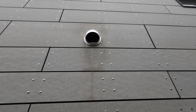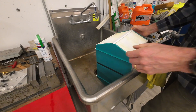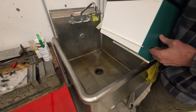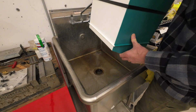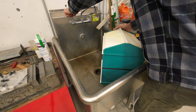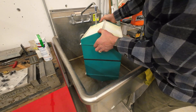For me the output is on the other side of the house and I can't get to it easily without a ladder, but I can at least check it and see how it looks — it looks fine there, if not a little bit dirty or moldy right where it comes out. So now it's time to clean the heat exchanger. They say you want to do it against the direction of airflow — I think the air is coming in from the bottom and going up through it, so I'm going to push water down the other way. They say that if it's green or blue like this it's okay to wash it; if it's all white you're not supposed to wash it. The instructions say hot water. I'm just going to run that through it — it doesn't look particularly dirty, but I'm just going to basically rinse it out.